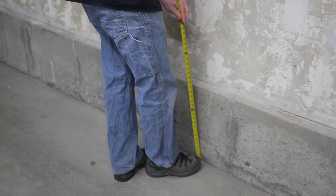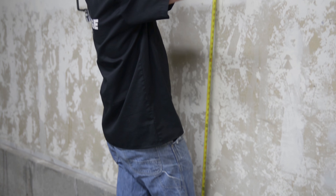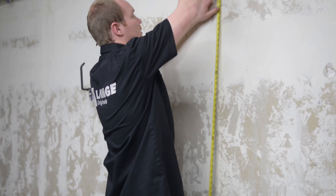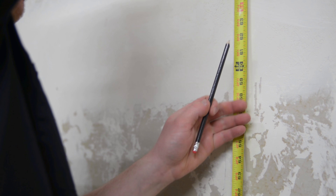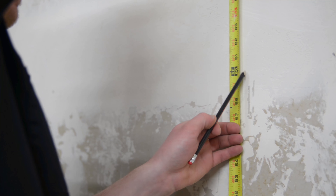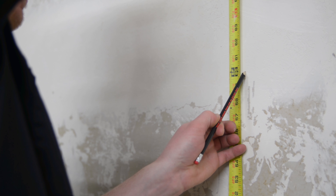Now we can install the come-along manual unit on a side or back wall, straight from the ceiling mark or 90 degrees from the mark we just made. Keep in mind we have a little less than 14 feet of cable, so we want to pick the closest mounting point. Next, measure 60 inches up and find a wall stud.